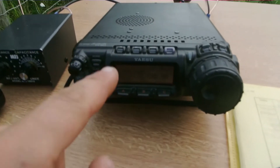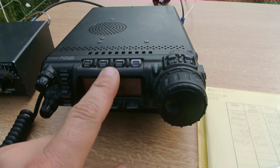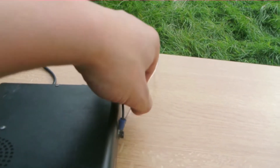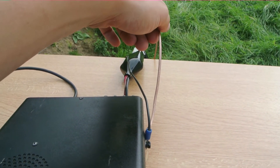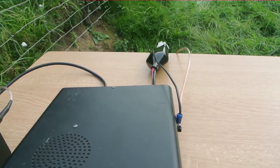What I've got here is a Yaesu FT-857, only running about 10 watts. Off the side comes this wire which is a counterpoise. This wire goes to a small ground stake which is there basically to discharge static, and you'll see why that's important in a minute.